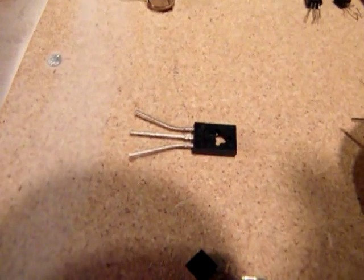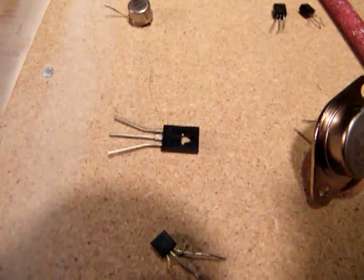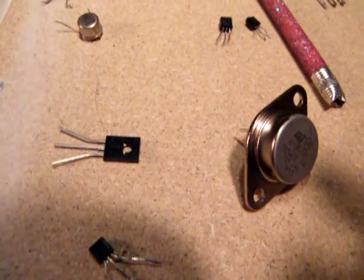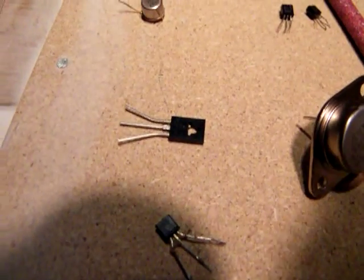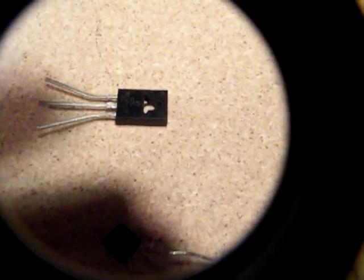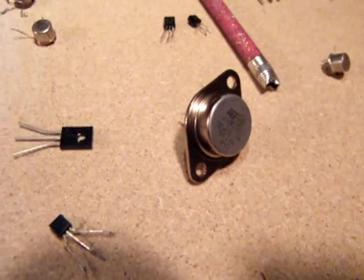When you want to make a switch circuit, it is important that the transistor has a good amplification factor. That's the reason why I often use Darlingtons. A Darlington consists of two directly coupled transistors: one medium power but with a high amplification, for instance this BD139, combined with a transistor that can handle more power, for instance 2 ampere in the collector emitter lead.